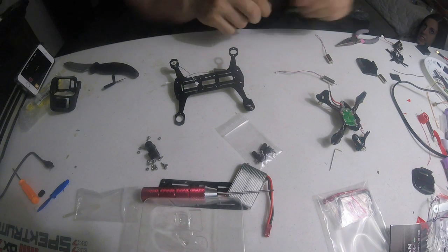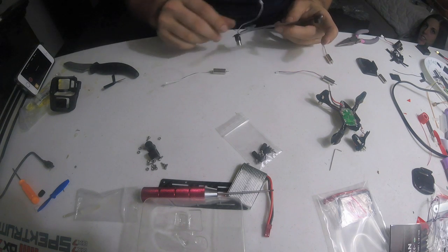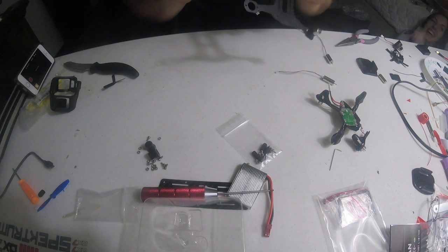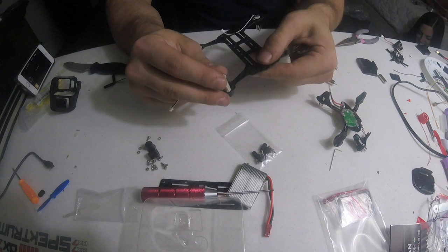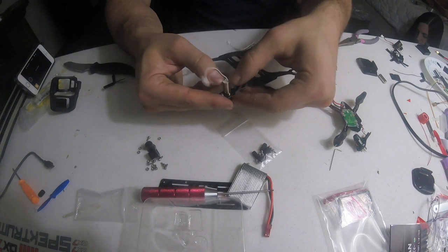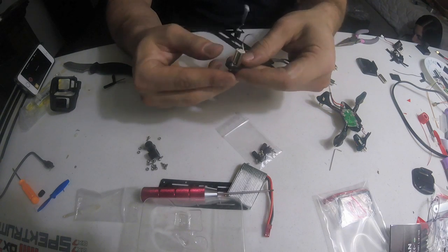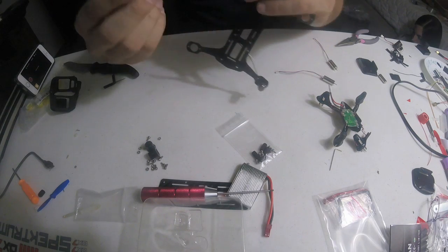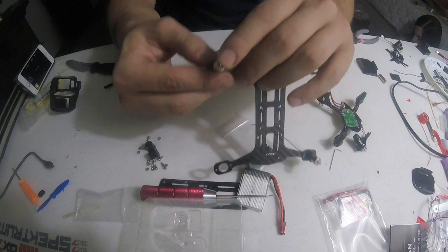Here I have the unfinished frame — pretty much self-explanatory. You have your nuts and bolts down there. You're going to want to connect the little motor mounts to the frame, and then once they're connected you're going to want to shove the motors right through there until it fits. These motors are 8.5mm so they're super tight, but they do fit and they're pretty snug once you finally get them in. I ended up just pushing the bottom of the motors down on the table against the mounts to get them right in there.